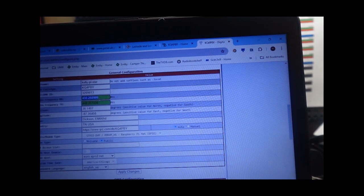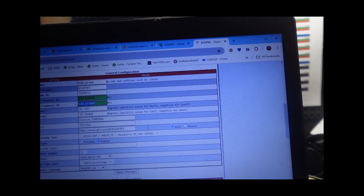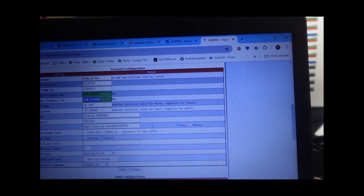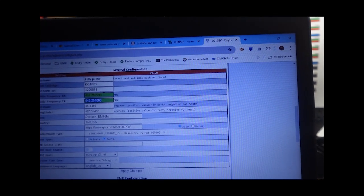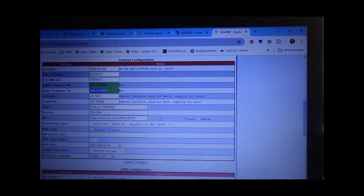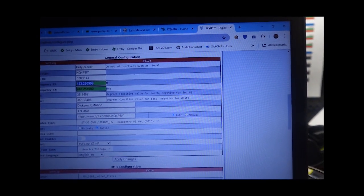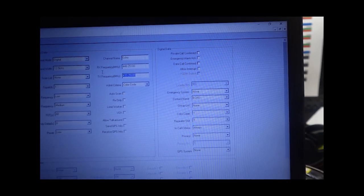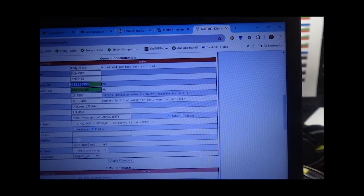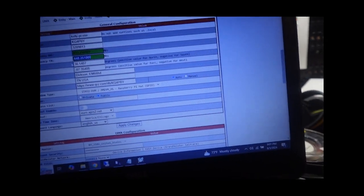And you notice I got over a 10 megahertz difference between these two frequencies. That's a requirement to keep the signal clear, because you want to keep the receive and transmit separated. So as you notice, like I said, receive and transmit are the same, and likewise receive on this side is the same as transmit on this side. And I'm sorry if I was confusing, but I wanted to make sure everybody understands that.